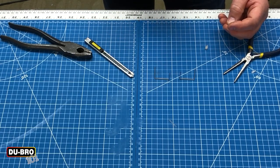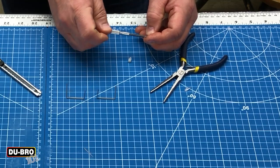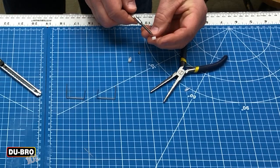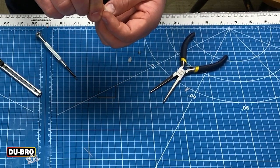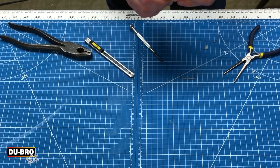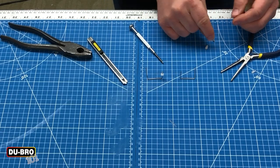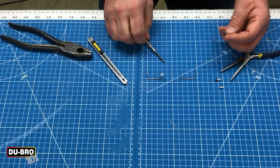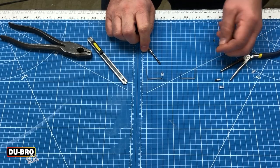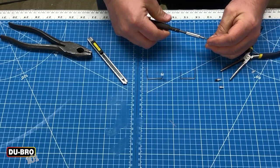There are 2 different types of screws included in the packaging. These screws, which are for a flat screwdriver, do not go long enough into this tiny hole that is going to slide over top of the pin. Save yourself some aggravation and make sure that you use the correct screws. So I'm going to get this screw out of here. I've brought back my Easy Link connectors, and you can see that these screws are a little bit longer, but I need a different screwdriver. A 5/64 hex head or Allen key will do the trick to get this screw in here.